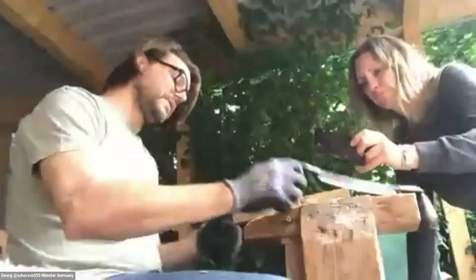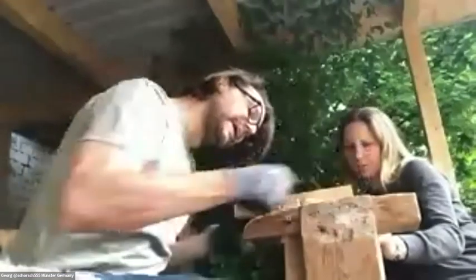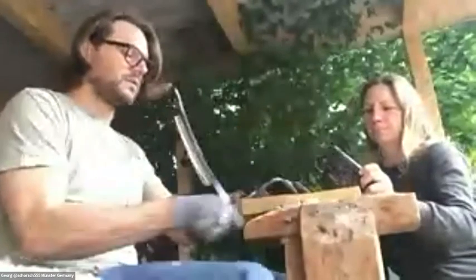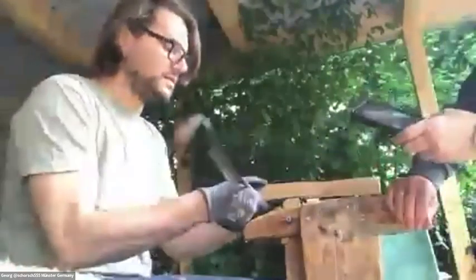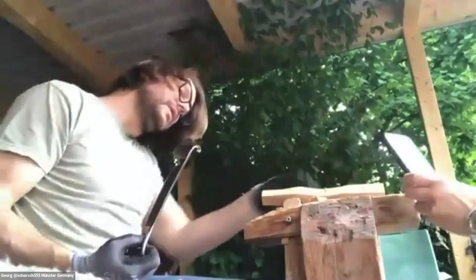I'm a right-hander, so this will lie smooth in my hand like this. So we have again to deal with the little grain change in this part. I need new leather jaws. If you notice, George almost uses his draw knife like an axe and does the helper facets on either side and then takes off the side that he just created. So a triangle, then cuts off the middle of that triangle, just like you do with an axe when you're axing out a billet.